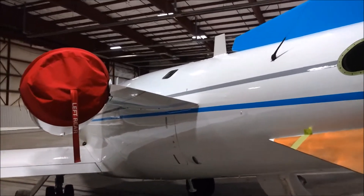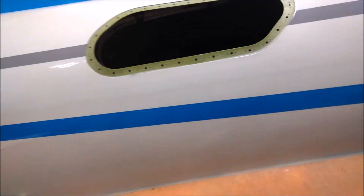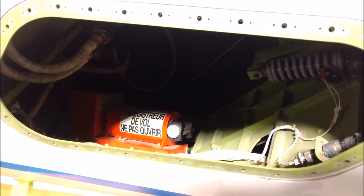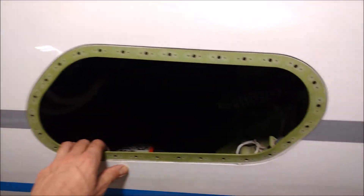Today at the shop I'm going to replace the battery on a cockpit voice recorder. The cockpit voice recorders and flight data recorders are located in the tail of the aircraft, in the back of the fuselage. This is the tail cone of a Learjet 45 and I have an access panel down. The orange component seen through this access hole is a cockpit voice recorder.